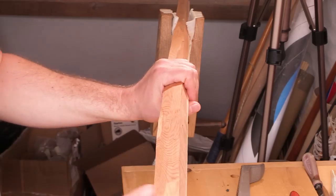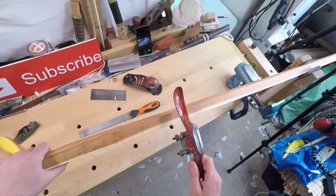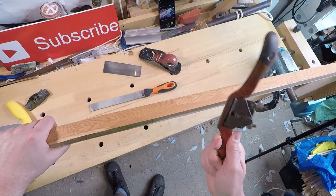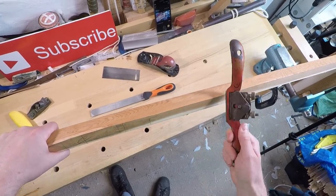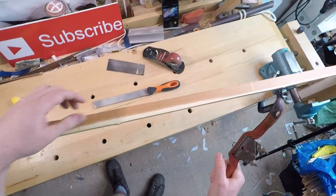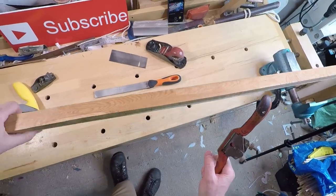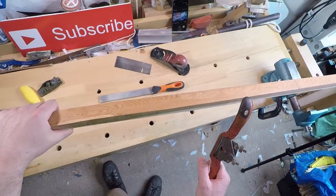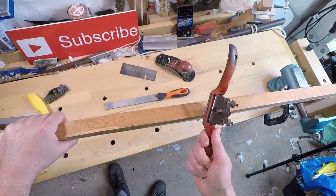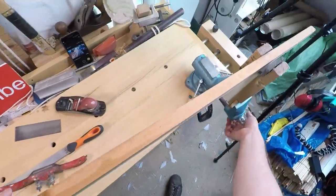And what I mean by picking up is, one of the main tools that we used, if you saw the other video when we're doing the roughing out, changing it from this square section to the D shape, is using a tool like this, a bladed tool. It can actually literally pick the wood up and it starts to peel away in big chunks rather than handy small amounts, which the lemon wood on that other bow that I was working on reacts well to being used with bladed items.